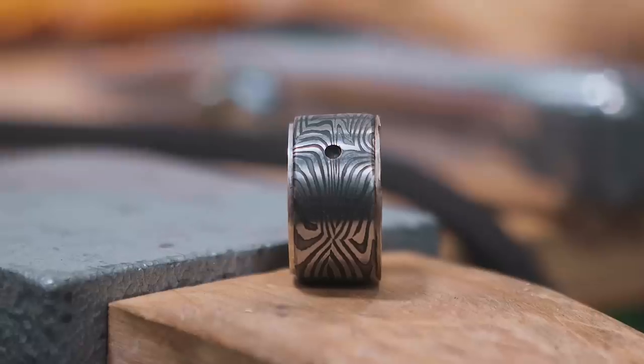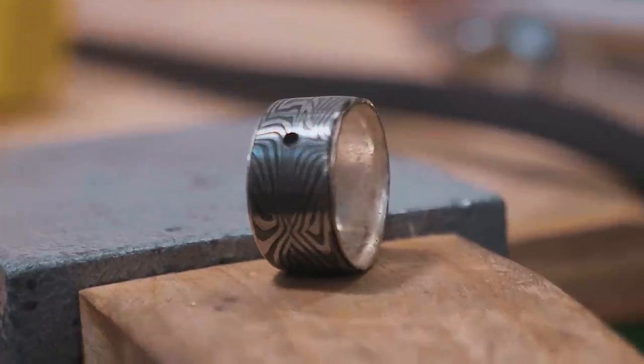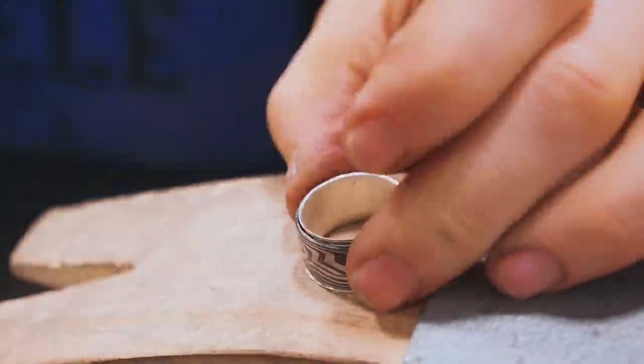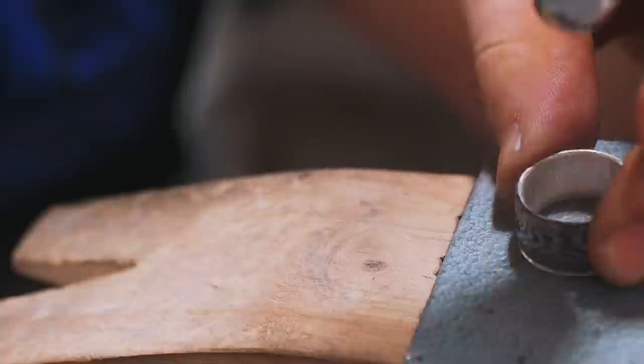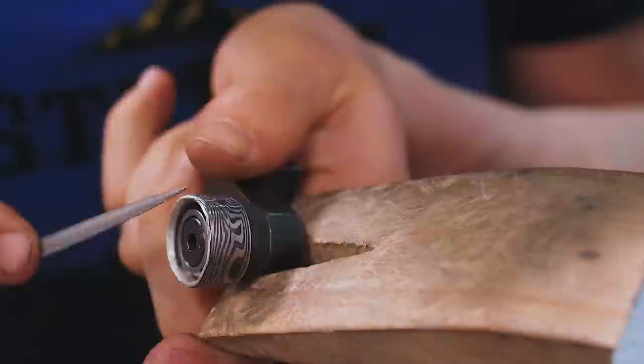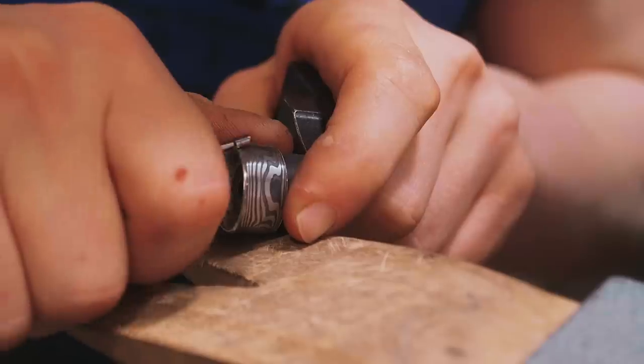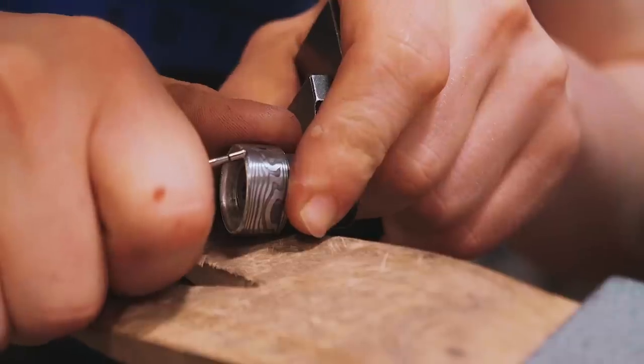I've got one edge curling over. I'm going to flip it over — the silver is still centered — and from the other side roll that silver over to encase the steel. Hopefully it looks nice and even. It looks good, and we're going to be able to move on to polishing up that silver. I'm now using a carbide burnisher in my micromotor, which seems to be smoothing out the edge nicely.